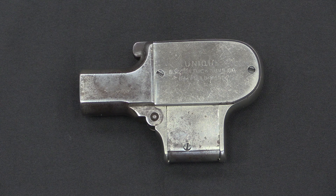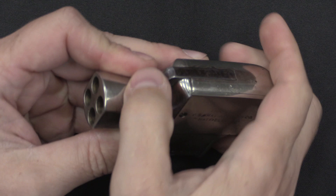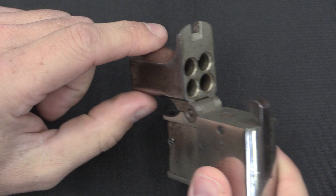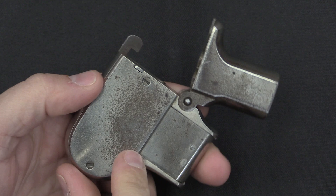We'll take a closer look because it's just way too small for you to see from back there. The gist of this gun is that it is a four-barreled pistol. There is a latch up here that allows you to open the whole mechanism up, and you can then load four cartridges. These were made in three different calibers: .22, .30, and .32 caliber rimfire. This particular one is .32 caliber. The .30 caliber rimfires are very rare to find. Mostly what you'll find are these larger .32s and a slightly smaller .22 caliber version — all of them four-barrel though.